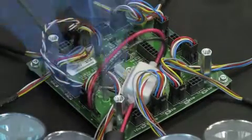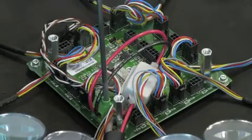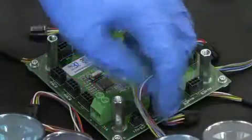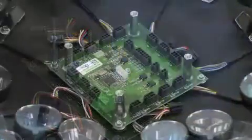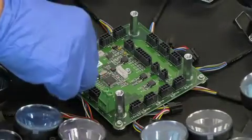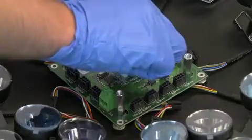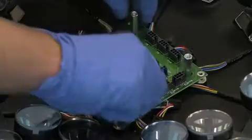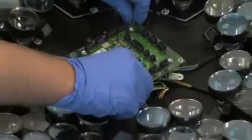Or, if you must replace the distribution board, you can continue disconnecting the other modules. To disconnect the modules, simply release the Molex connections from their ports. To replace the central distribution board, remove the outer perimeter screws. There is also a central screw to the distribution board, which is critical for grounding. This screw must also be removed to free the distribution board from the dome.